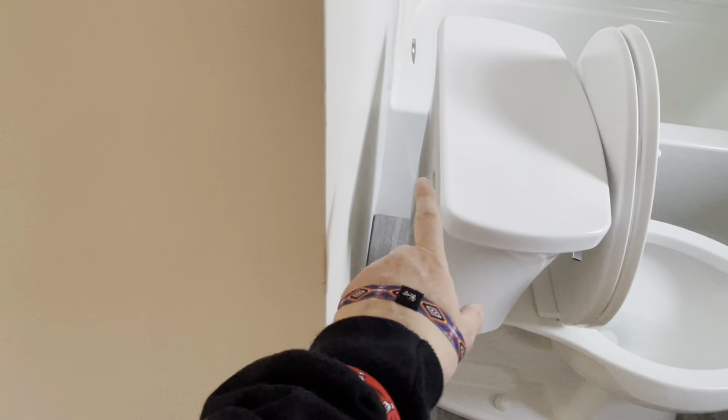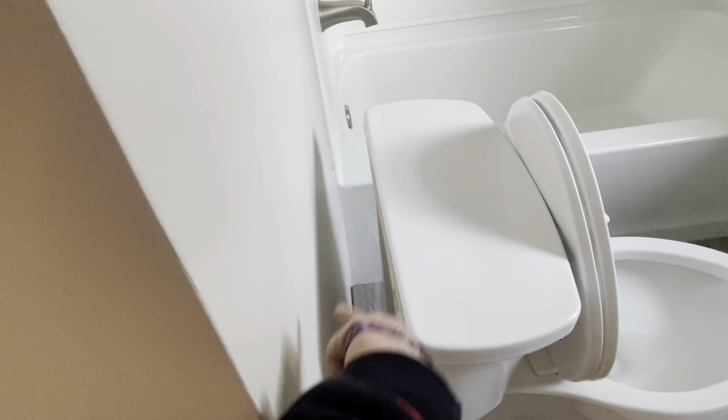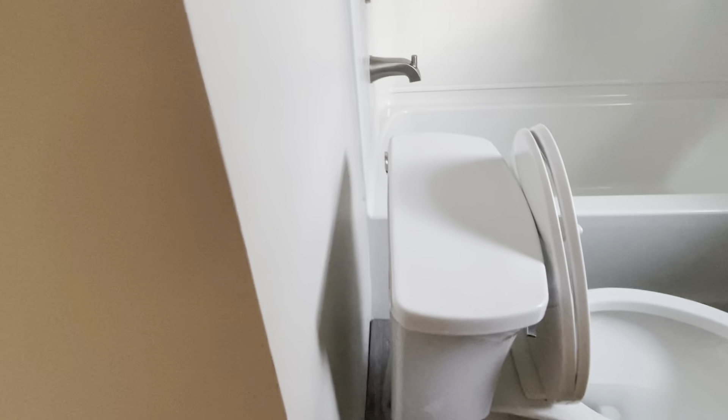And then we're going to build the wall out just behind the toilet — like a three-sided box — that'll bracket-mount to the real wall. So if we ever have to get to the tub or pull the tub, you'd move your toilet and just move the three-sided box. On top of this three-sided box, we'll build it about this high — maybe an eight-inch shelf — and put a little piece of marble across it. So we can frame out a little wall behind the toilet, bring the bowl in because we'll do a round bowl, and then have a shelf there. It's going to look really, really nice.